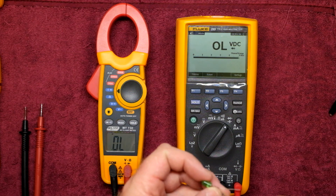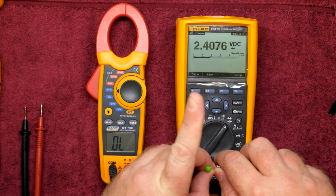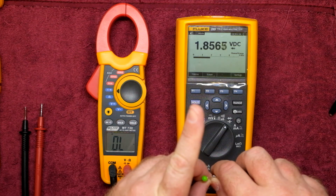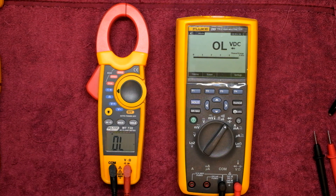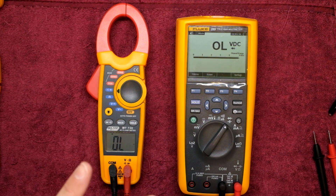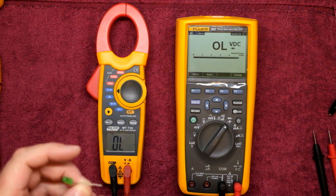The Fluke, when measuring an LED, can actually switch the LED on and measure the 1.85V volt drop. This MajorTech won't switch it on and cannot measure the voltage drop on the LED because it's too high. So that's out of the question.